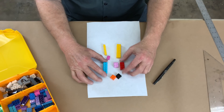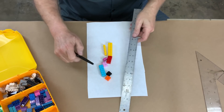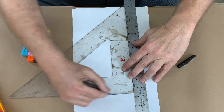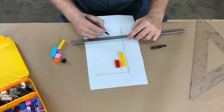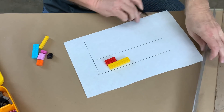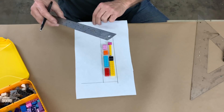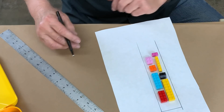I made a selection of basic Lego bricks, laid them out, and figured out what kind of mold box we're going to need. There's our first corner — two inches is going to do it. It's just about how big a box to build. I need to remember I'm going to need a hinge area in here. I think seven inches is going to be just fine. Let's go cut some wood over at the table saw.